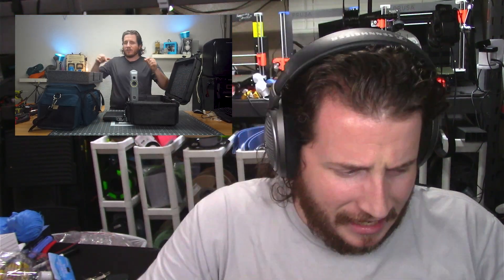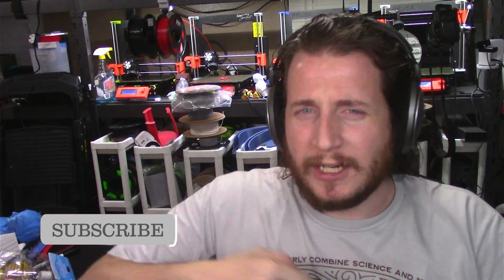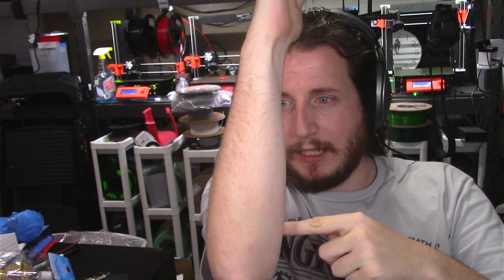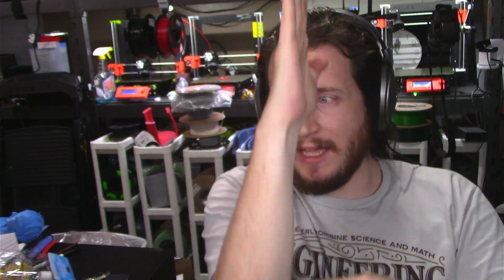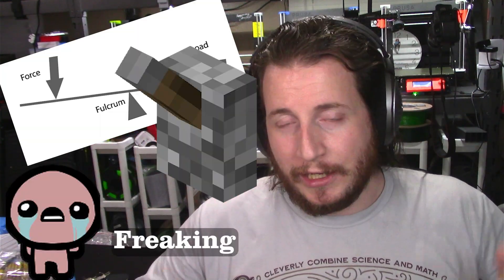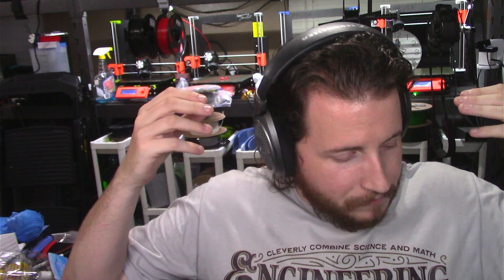We'll link to that video where I take a look at the Artec Ray for the first time — still, to this day, the most expensive unboxing I've ever done: $80,000 of 3D scanners. More scanning content coming soon, so make sure you get subscribed. This deals with the fact that even a small error down low starts to be a problem as you get higher up — a very small movement here adds up to a ton of movement at the top because of fulcrums, levers, and Isaac Newton. There is no way to solve this on bed slingers.